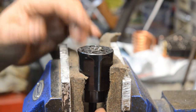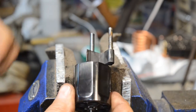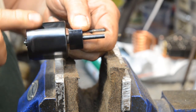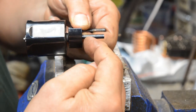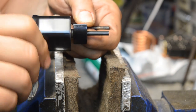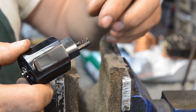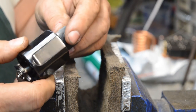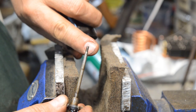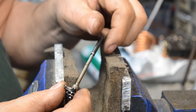I'm detecting a few things right off the bat — all of this is loose, this has got a lot of slop in it, and the guide rod in the back: let me demonstrate the run-out on it. You see it going up and down? In this particular gun it doesn't lock up on that rod, but any time this rod is eccentric and nubbing around like that, that's not good. This thing was so loose I was able to pop it off with my fingers — a little too loose. Those are some very fine threads right there that will strip on a moment's notice.